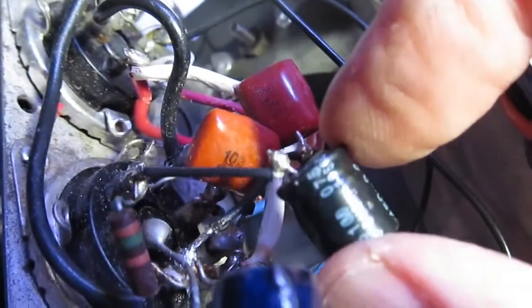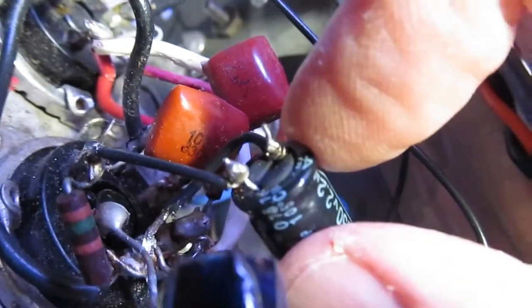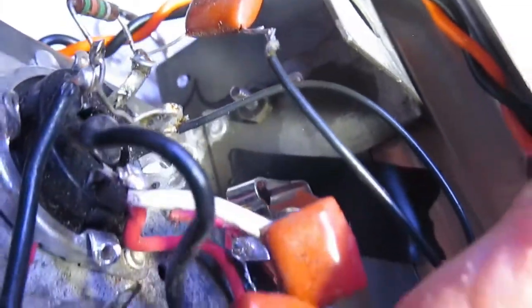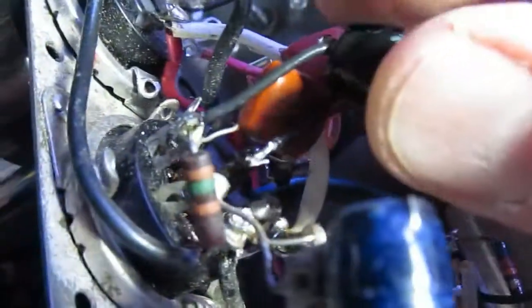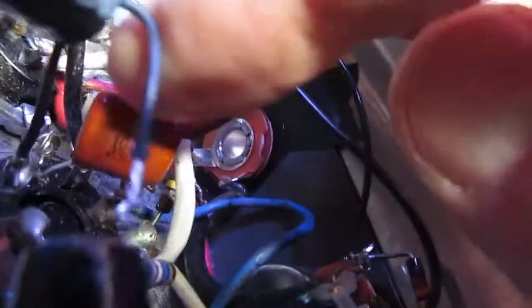Back in those days I was just using parts from other things I would find — I obviously pulled that off a circuit board and stuck it in here. That's fine if you're just testing something, but you should go back and put an actual part with proper leads, and not have it flapping in the wind. In fact, that's loose — that might be the problem right there.